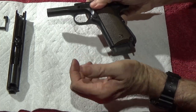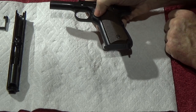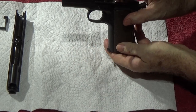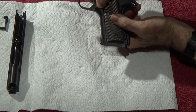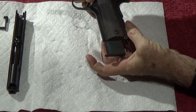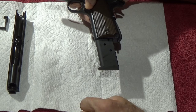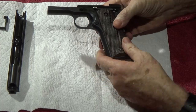Now we can test our work. Here's the first test: put an empty mag in there and see how hard it is to get over the new spring. I can already tell that's about half what the other one was — a lot easier. Push the button — we don't have to stand on it anymore. It comes out nice and smooth. Pull in just a little bit, push the button barely, and it comes out easy. That's a big improvement.